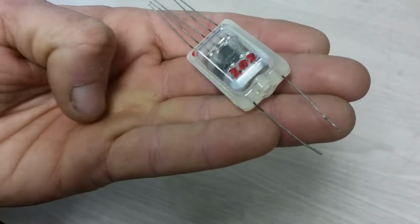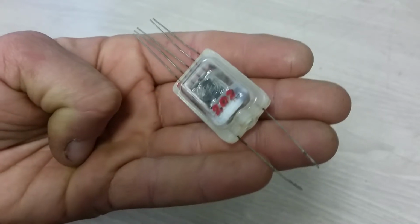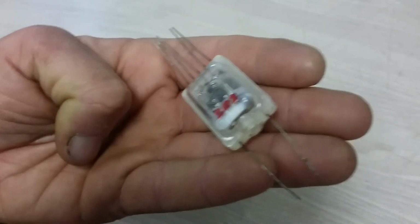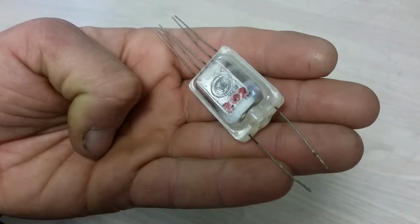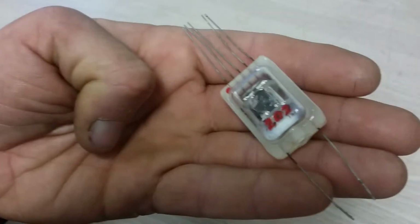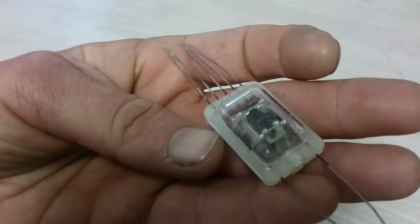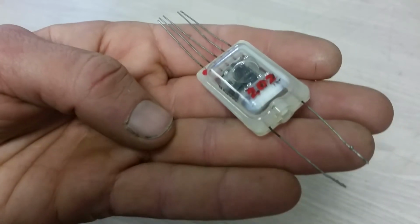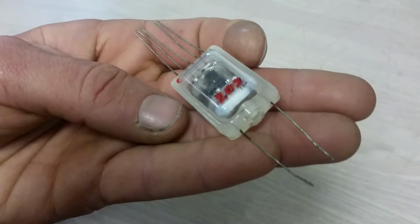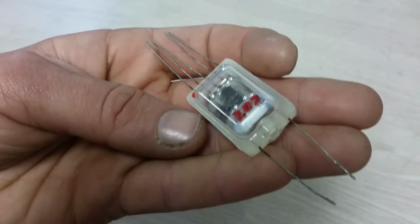Also think about it. If the vacuum chamber trick did work, all those audio guys with their $3,000 Western Electric 300Bs, the ones that are starting or have gone gassy, they'd be trying like crazy to get that gas out. It's been tried, doesn't work. Maybe at some point someone will figure it out, but at this point it just doesn't seem to be working. So anyway, that's what this is. It is a gassy Westinghouse WX3506 Reliatron Matchbox tube. Yes, Reliatron, that was the name. That was kind of the brand name. An interesting dead end in tube technology, and just a curio at this point.